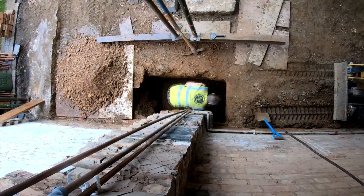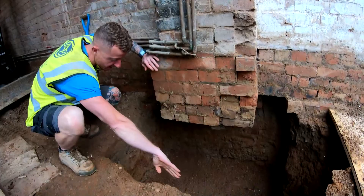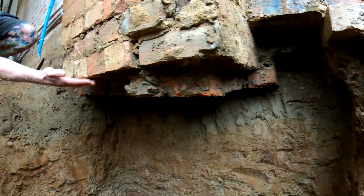We've finished excavations. Important things to remember: when you've dug out your hole, you've got to make sure all the corners and edges are nice and squared off - no rounding - so you've got a good solid foundation. Also the bottom of the bricks underneath - we've cleaned up all the clay as well. It's important to make sure you've got a good solid foundation against the bottom here. You don't want any clay on there because that's going to impede the structure and integrity of it.